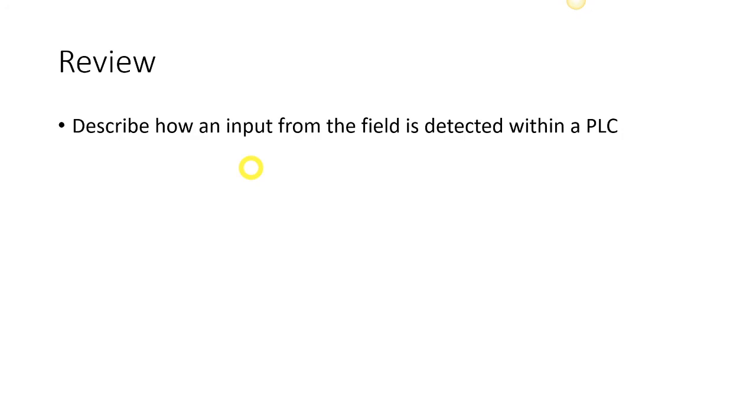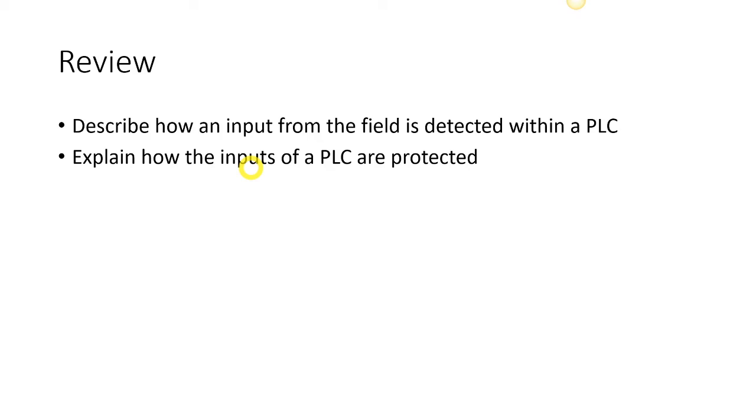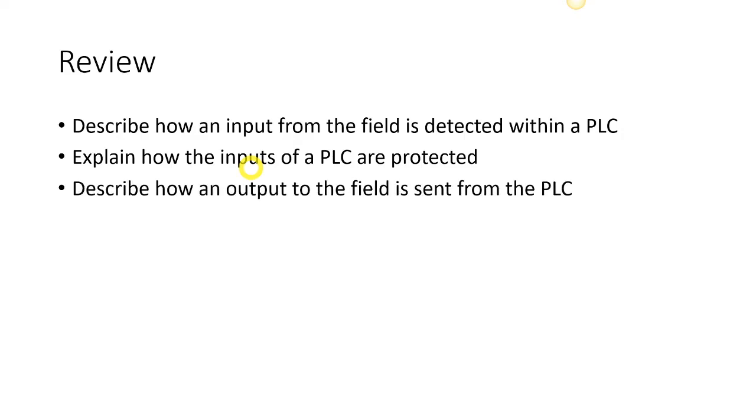We're going to supply 24 volts into an input channel, and that 24 volts is going to be isolated from our input circuitry inside the PLC through optical isolation, using a light emitting diode that will react a photosensitive transistor. And since there is no electrical connection through that light connection, we are isolated from our input voltage. If we have 24 volts, we will have a logical true, and we will store a 1 in an input table saying that we have a true. And if we have 0 volts, we will have a logical false, and we're going to store a false inside our input table.